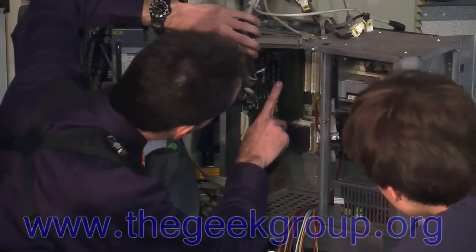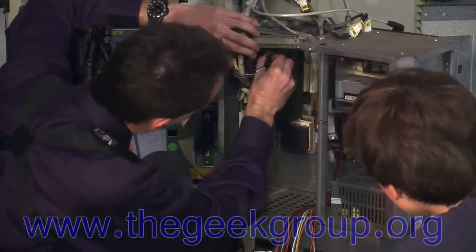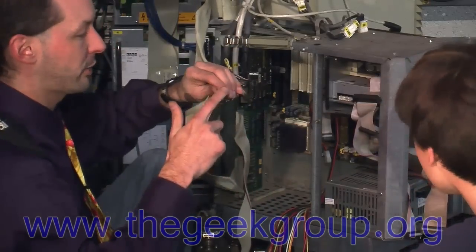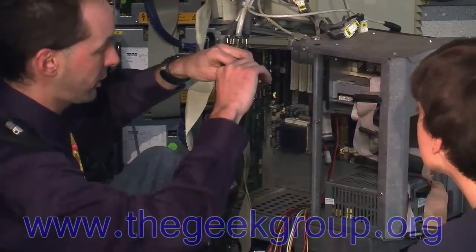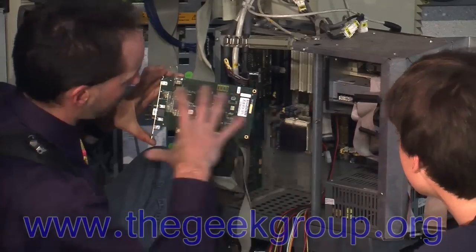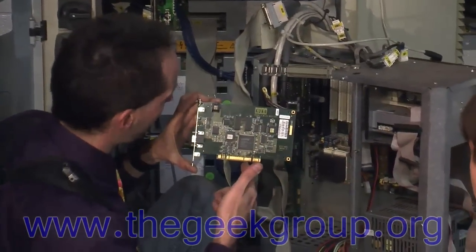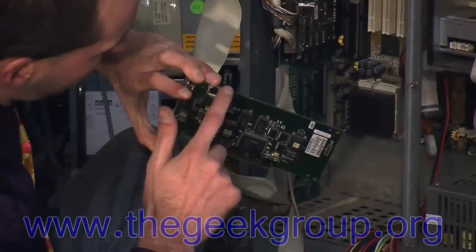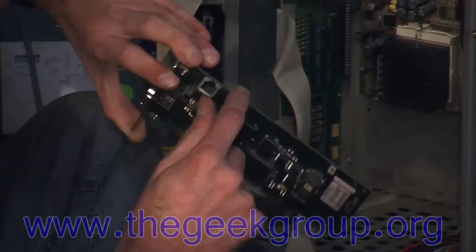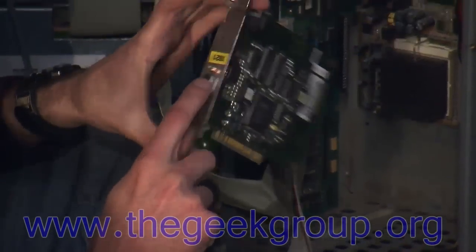Now, this is the video card. And I bent this out of the way because it wasn't seating properly, so let's bag that. Now look at the video card, and you'll notice it's right there, KUKA, which tells you custom silicon right off the bat. It's a PCI video card, but it has this RJ45 connector up here, you know, for the Cat5 pendant. That feeds video to the pendant. And then this is your external monitor.